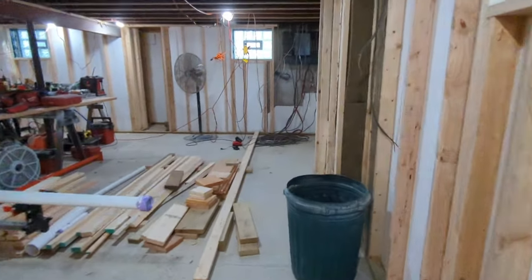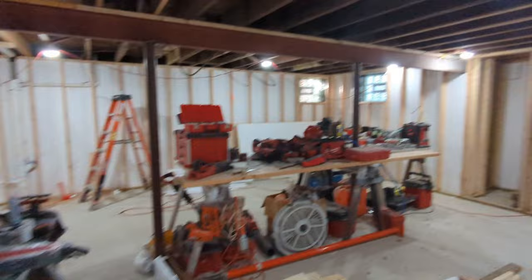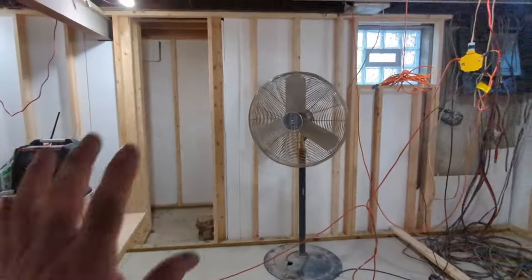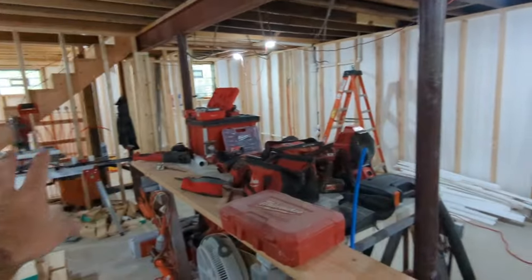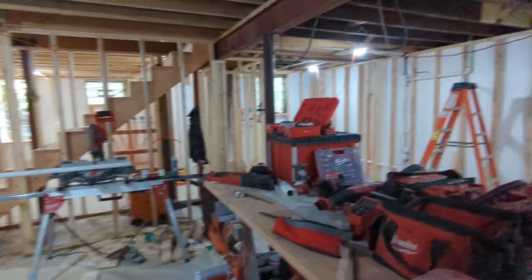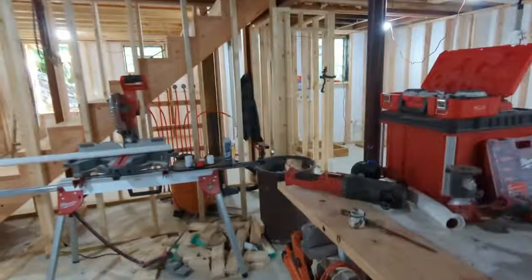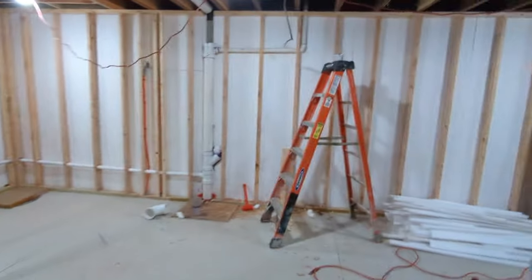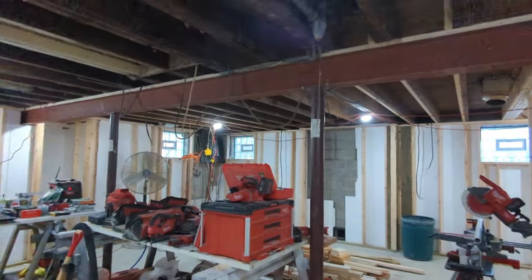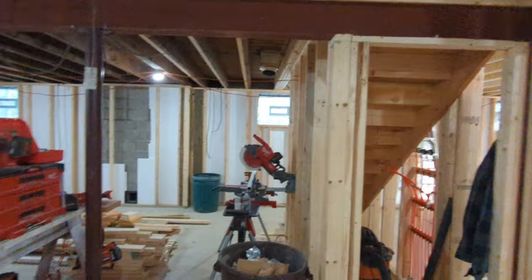I've been sort of trying to inform them that the cost is so similar to a mini combination, or a combination hot water, potable water and heat unit. I'd like to sneak it into this room or underneath the stairs over where we put our manifold. Then we would leverage the fact that we put the PEX in this floor, and this would be heated. They would come in and put the same kind of radiant piping in this ceiling down here. This would heat your first floor, and it would all get set up to the on-demand unit that supplies hot water that you can drink or have a shower, and it would heat the glycol in these systems, and the pumps on that system would circulate those and run on thermostats and stuff like that.